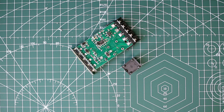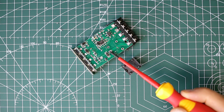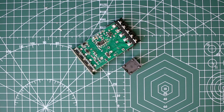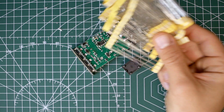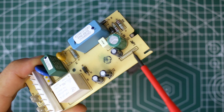The relay is removed. Now I have to make a new connection on the board. I have to connect this point with this point and this point with this point. I will use a jumper wire to make new connections — this wire is used to make connections on the board, like this one.